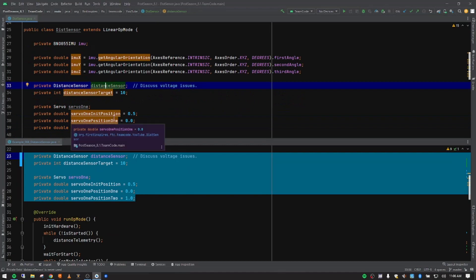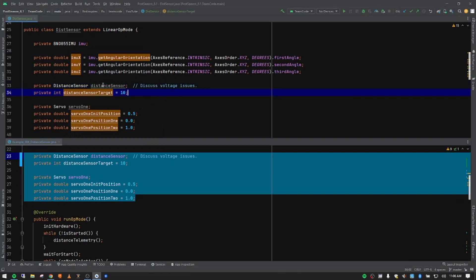Let me talk about the voltage issues that sometimes happen with distance sensors. In our experience, as the battery starts to lose its charge we sometimes have problems with I²C sensors. The IMU doesn't usually cause problems, but specifically with distance sensors — if the battery drains a little bit, you'll start to get that error sound on the control hub and the sensor may start to lose connection. If you're hearing that error a lot, that's likely what it is.